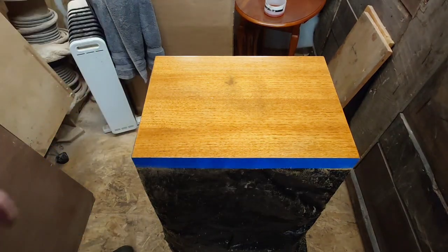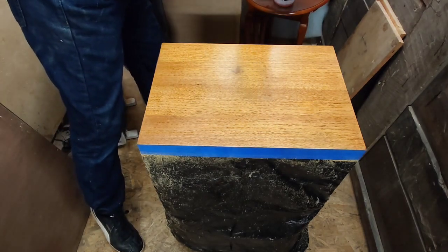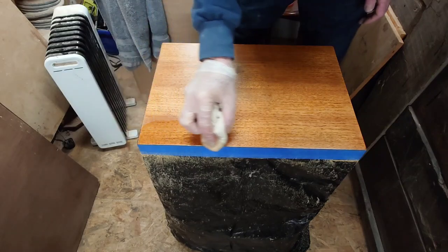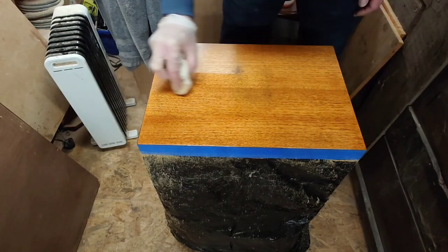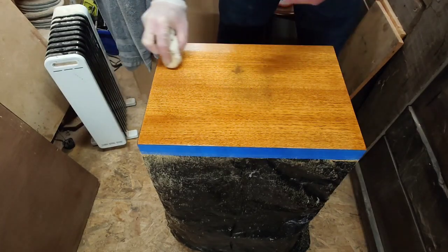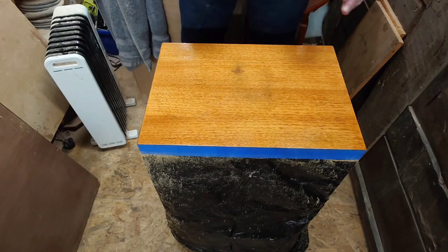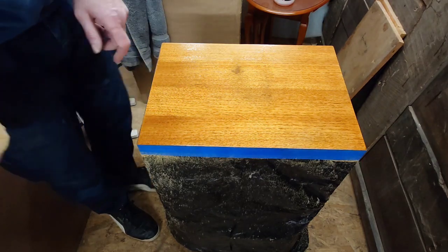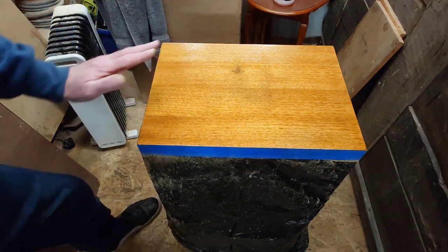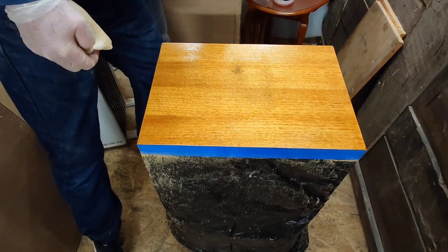That's one coat on there. We'll leave that to dry and build about three coats up, then address the false grain. The reason I give it three coats is because it brings out the grain a lot more — it highlights the hints and tones, as opposed to just one coat which fades back quite a lot when it dries. When you look at real wood you get hints and tones, and from one angle it looks dark and from another it looks lighter — and that's the hardest part of this job: trying to match it so it looks like grain both ways.